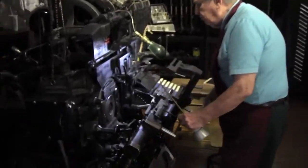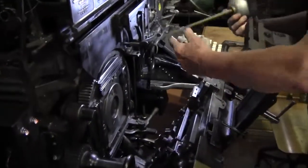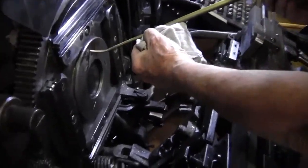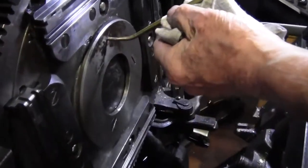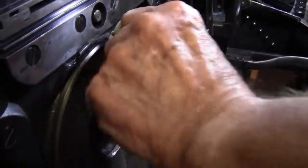There are many oil holes on the machine. We might not get all of them, but we're going to try to get as many as we can and then come back later to see the ones we miss. There's an oil hole right here — a very important one here in the disc. Just drop oil in there and wipe off the excess.